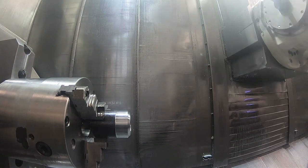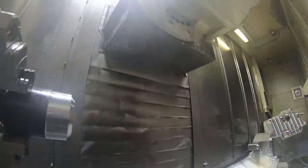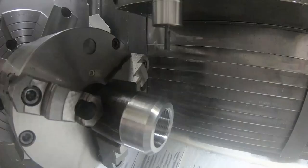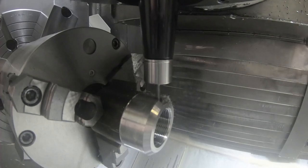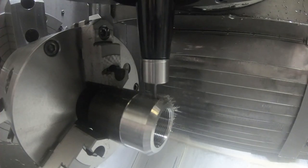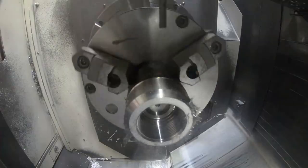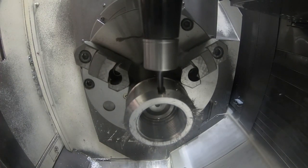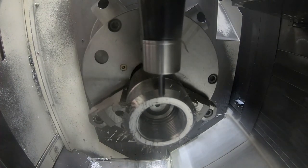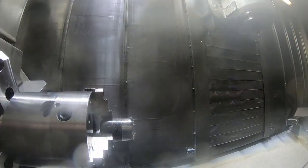And then I also had to set up a new tool for this because I didn't have it in the changer. It's a 3/16 4 flute carbide end mill. Do these wrench notches. It's like you saw when I programmed it, a trochoidal roughing cycle, and just to finish the walls. This is sped up quite a bit, so it looks kind of funny, but I think I sped it up maybe 5 times faster than normal, just so we wouldn't have to wait forever to see it.